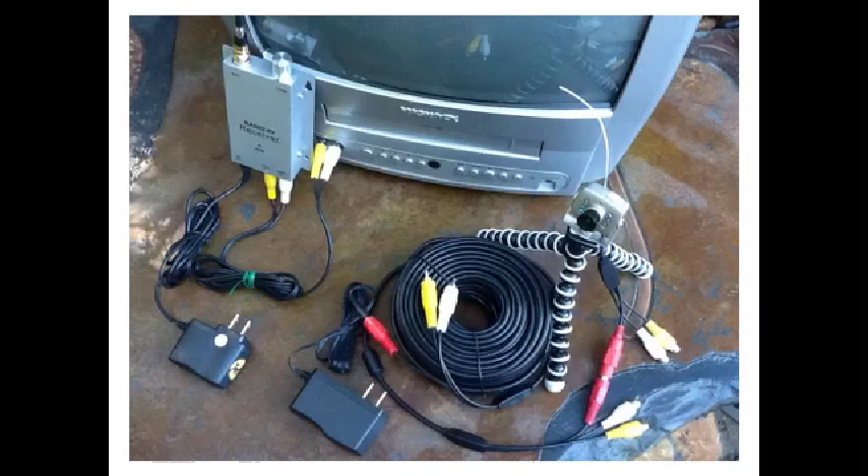As I said earlier, although this is a wireless system you still must get electricity to the camera. By far the easiest and most importantly safest way to do this is to use the one hundred feet of low-voltage cable that comes with the system. Notice here how only the red electrical power leads are plugged in — both at the power adapter inside as well as outside at the camera. The audio and video leads at each end of the cable are left unplugged. As this is a low-voltage nine-volt system, there is no danger if the cable is cut by a wayward weed whacker or lawn mower.